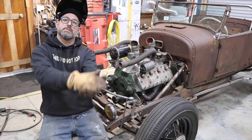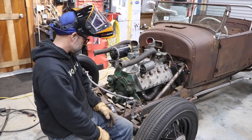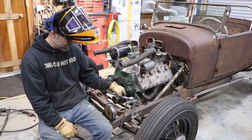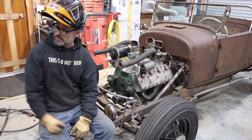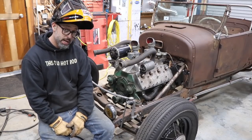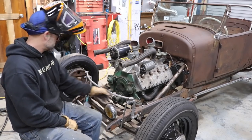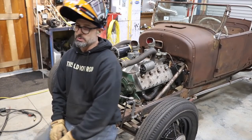Alright, let's try this again — my battery died, then I started filming and didn't hit the record button. I need six and a half inches for my uprights — actually six and a half including the quarter-inch thickness of those mount plates. I'm going to get two pieces of tubing cut, put them in place, cut off the uprights, and get this welded. Then I'll cut those tacks off the table, bring it to the other side, and set up with the TIG welder.